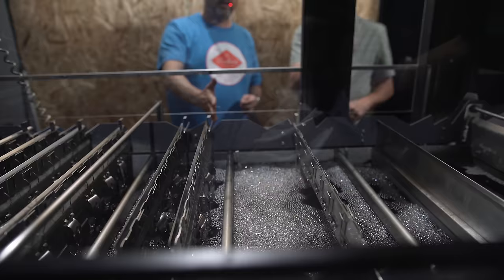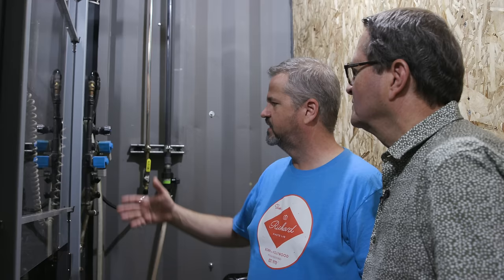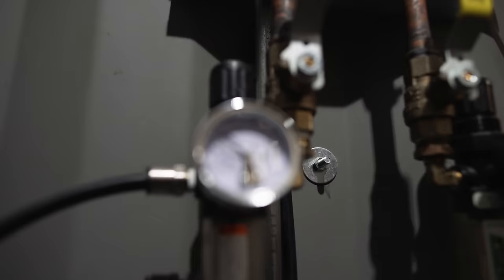So developer and then bleach. And then bleach, and then there's a wash, and it washes off the bleach, and it sits there, and then it moves into the fix tank where the fixer removes the silver from the film, and then it moves into a wash tank where the film is cleaned, and then into a final rinse, which is sort of a photo flow solution, wetting agent, which assures a clean and clear drying process. Yep. From there it goes into the space between the wet section and the dark section, which allows it to pass from dark to light, and that enters the dryer then.